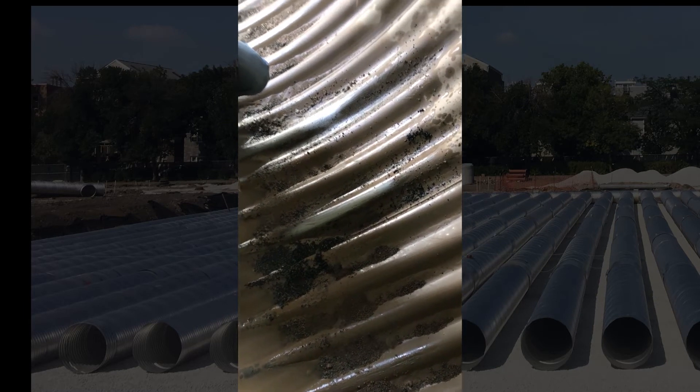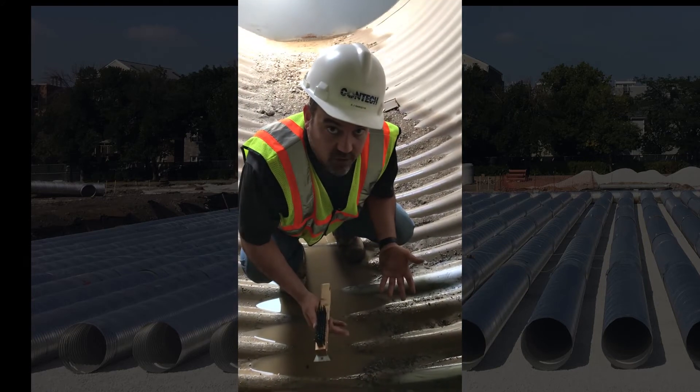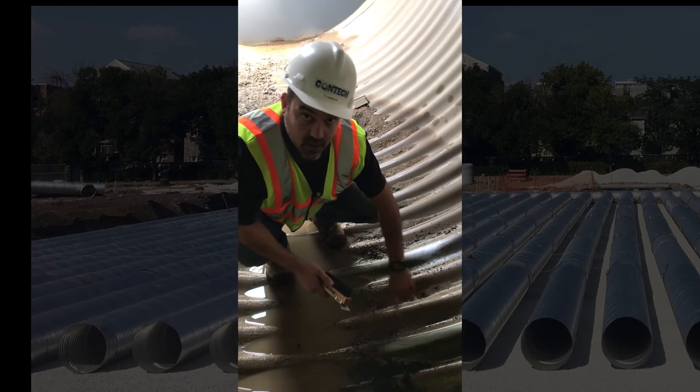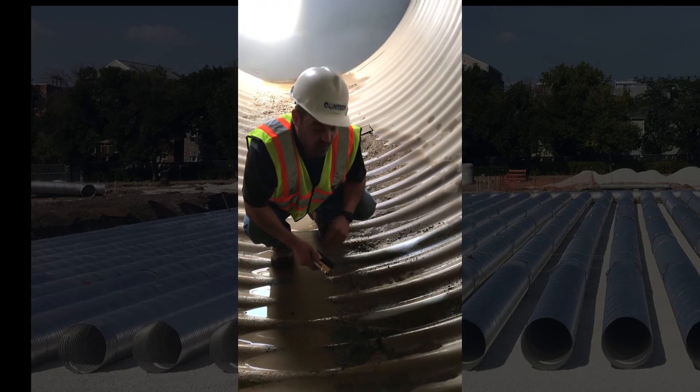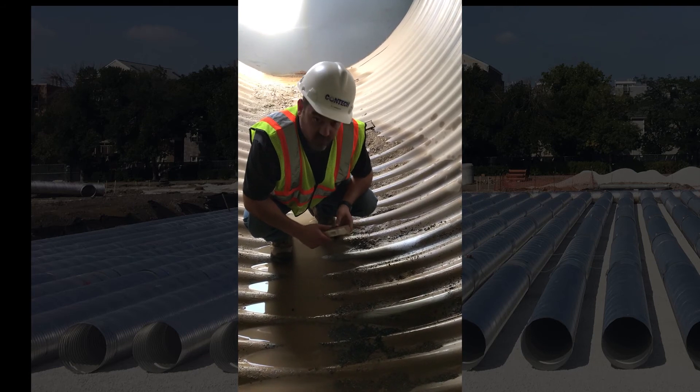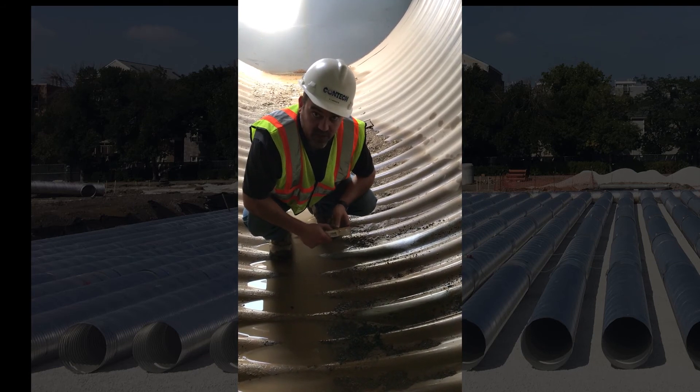This is unlike what you can see in a galvanized culvert. In a galvanized culvert, if you did have rusting, you would not be able to scrape that staining away — you would just continually see your rust formation. So that's the difference between aluminized and galvanized.